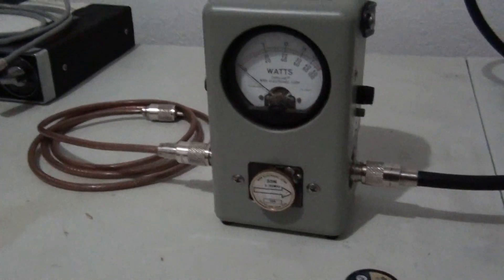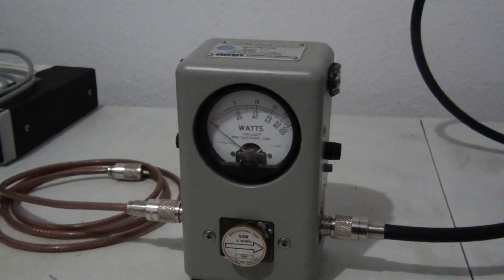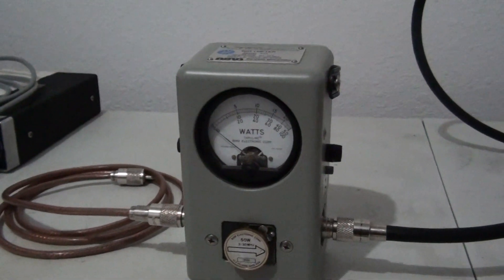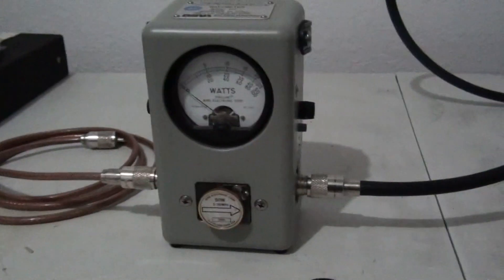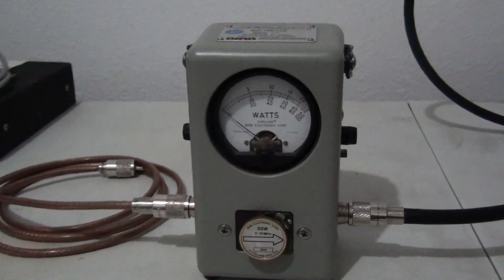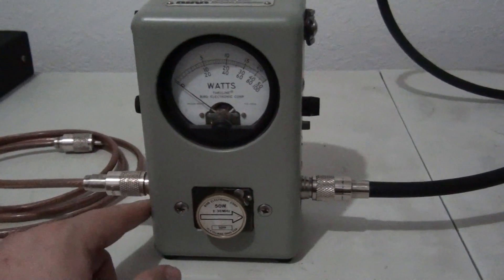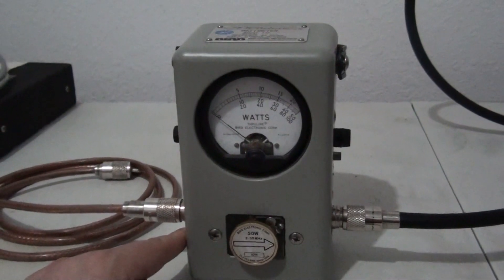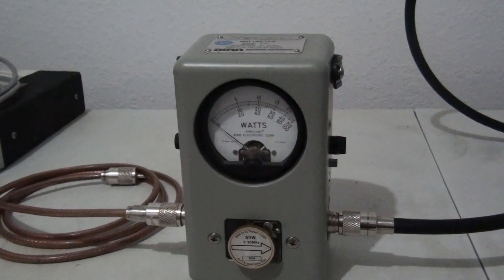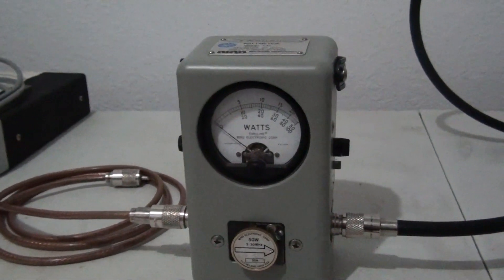I'm sorry this video ran a little bit long — it's a lot of talking and not a lot of action. Hopefully I got the point across about how important it is to have a good watt meter. It's just as important as anything else. If your tech sells you an amplifier or you buy one and he makes a suggestion about how much drive to put in it, that suggestion doesn't mean anything if you don't have a similar tool. Whether you buy an amp from this guy or that guy, or buy a whole station from somebody and they set it up on their bench — if it's doing one thing on their meter and you get it home and it does another, you could run into issues.